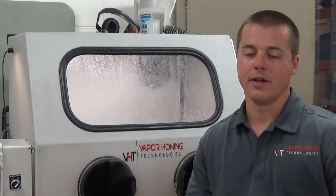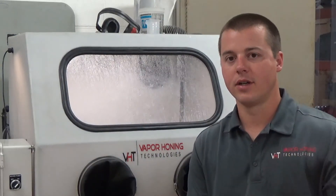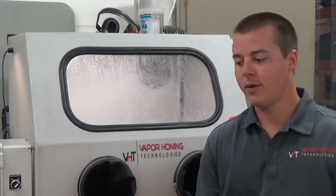However, if you look at duty cycle, rotary screw compressors are obviously the best — 100% duty cycle, quieter, and they give you more efficient, cleaner air. Going back to the piston side though, for us as hobbyists that's perfect for what we need: something affordable that works when we need it. I have an Ingersoll Rand 60 gallon vertical in my house that produces 18.3 to 18.5 CFM, which is perfect for an 800P, a 1000, or any of our machines. That's what I recommend for compressors.